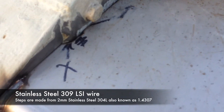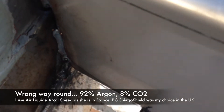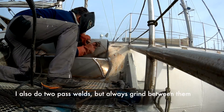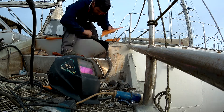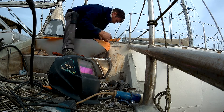I'm still using the standard CO2 and a little bit of argon gas. Technically you should go for an argon gas with stainless, just to ensure you don't get blackening of the weld, but on a single pass weld like I do, it seems to work fine. I mean, a stainless on that I welded 20 years ago, and it's nice and shiny — there's no rust on it or anything like that, other than what you get on 304.